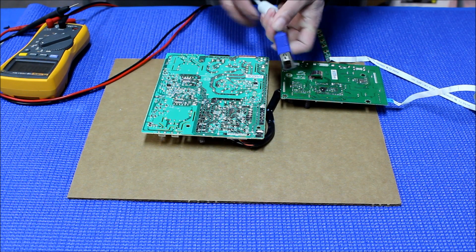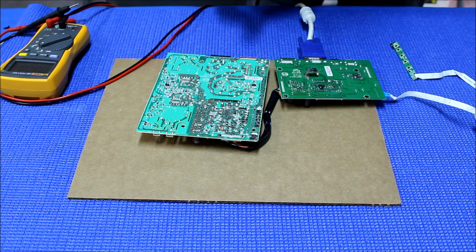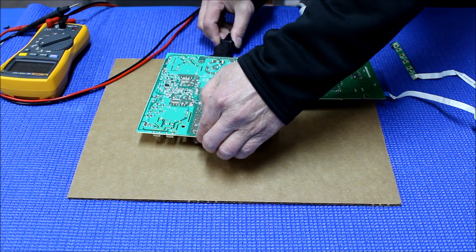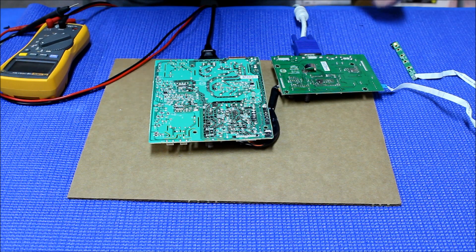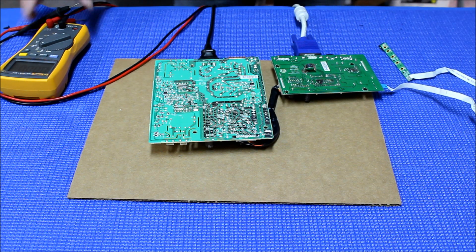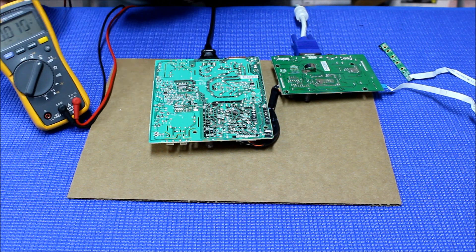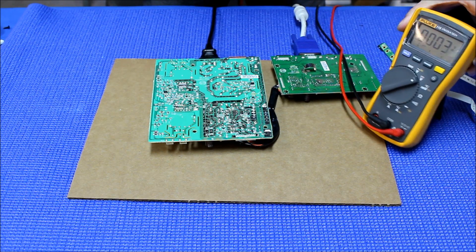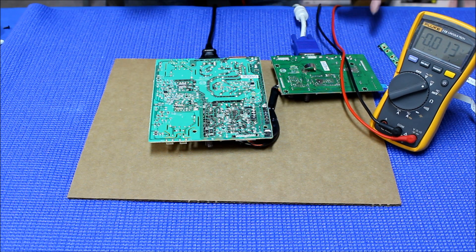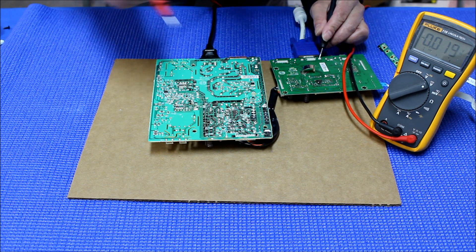Connect the VGA, make sure it stays on, and connect the power supply. Be really careful on this LIPS inverter because you don't want to touch certain sections and get zapped. Get a piece of paper and pen to record the measurements. The chassis has not been turned on yet, so connect to any ground, do the measurements, and record the voltage on the connectors.